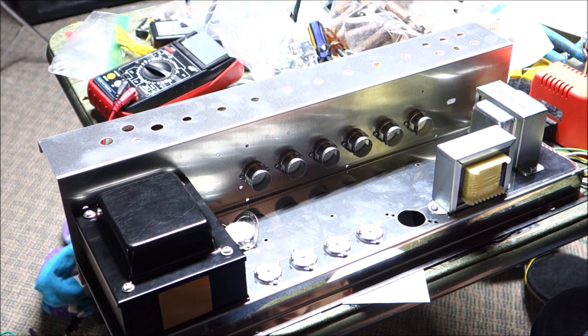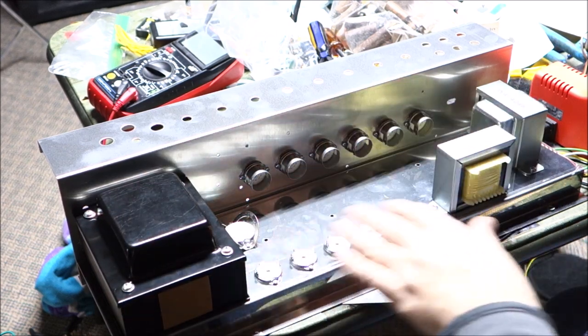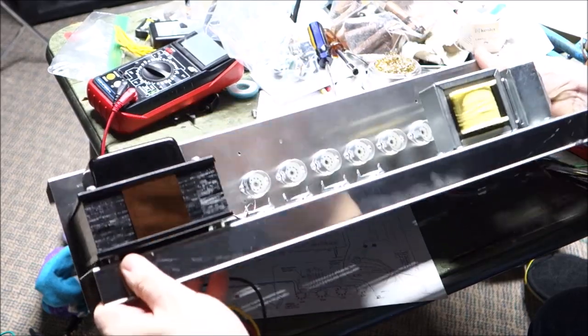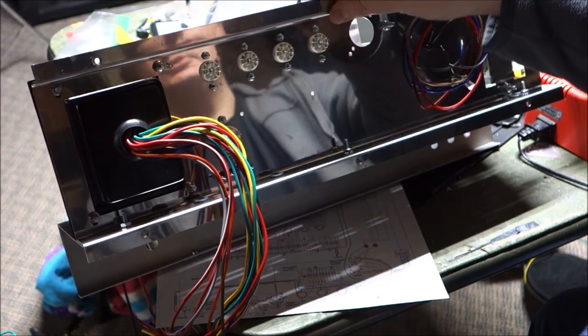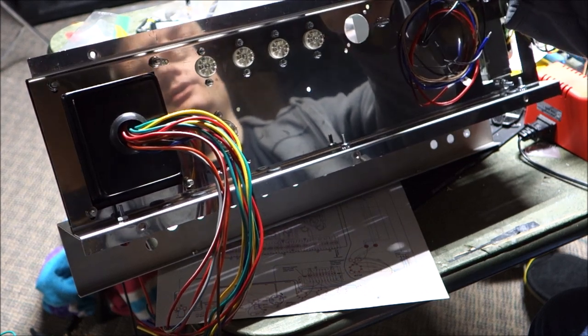I swear that's even on like the 80 watt twin style amp. Okay, I mean, this thing is just physically massive. It's huge. But I imagine the filament winding has to be big to handle all of these tubes. Choke, output transformer, and on the power transformer, the one leg here, just like on the diagram, we put the tab, the solder tab. So far we're sticking to the diagram, and we're going to move forward.